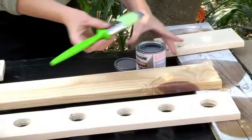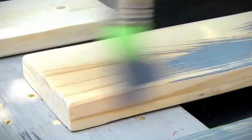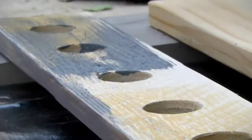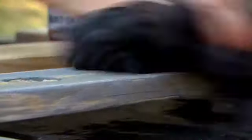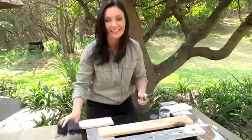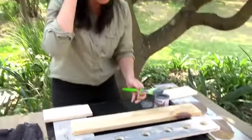With the wood sanded, we can get to staining. I've decided to go with a beautiful gray weathered colored stain — I think it's just going to really complement the whole project and the see-through glass bottles. A good tip with this type of wood stain is to apply it as sparsely as you can, like dry brushing, and then go in with a rag to make sure it sits in all the grains. I like the fact that the gray isn't covering the whole piece of wood but letting the grain show through.